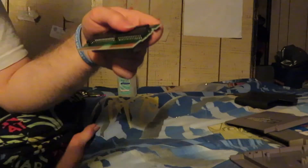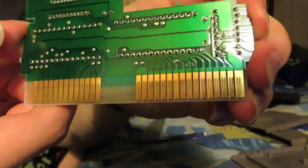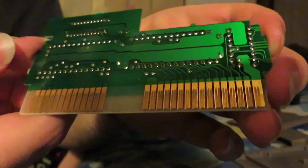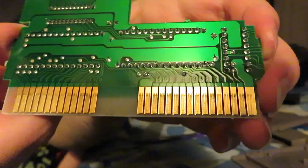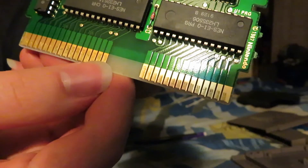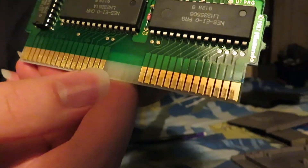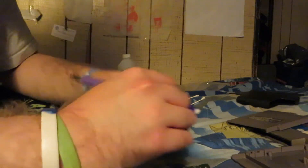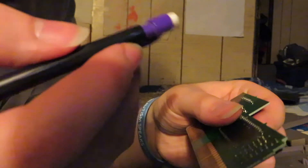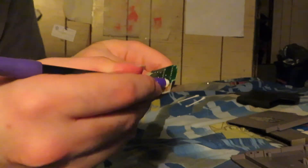That's pretty much said and done. Even though the cartridge circuit board looks cleaner than it did a few minutes ago, there are still some spots that are pretty dirty. You might want to do a second scrub with isopropyl alcohol or whatever other solution you have for cleaning contact points on game circuit boards. The next step, if you're not satisfied with cleaning with alcohol, is to take a pencil eraser and just rub it against the circuit board.